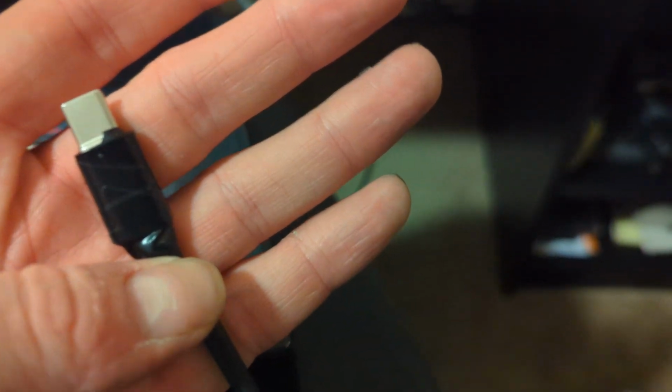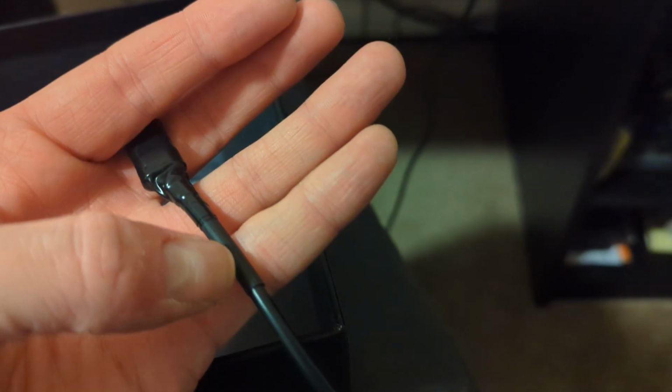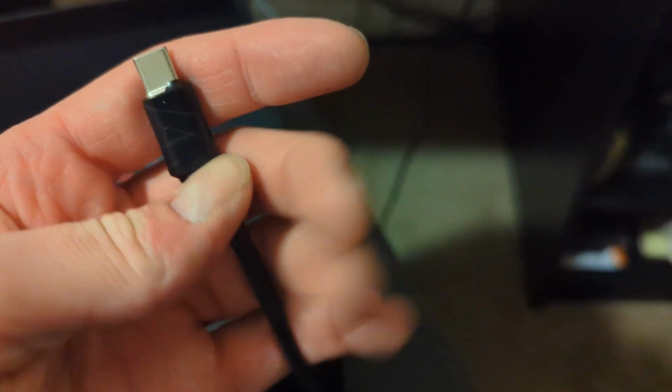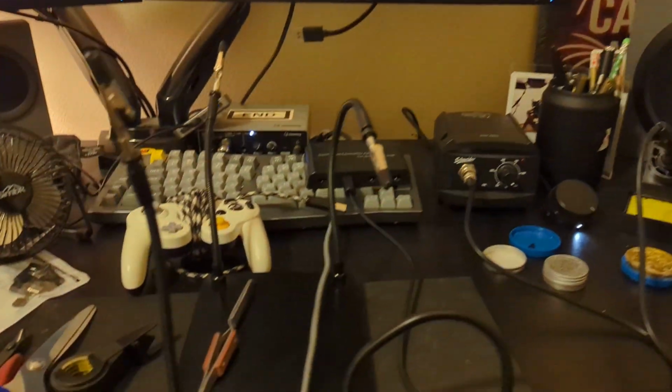Come on, focus up. So I just took a GameCube extension cord, cheap on Amazon, so I don't have to ruin a real GameCube controller wire, and then I soldered the 5 wires inside of it to this little baby thingy here, pretty easy, and it plugs in here, and then it gets seen as a controller, theoretically.